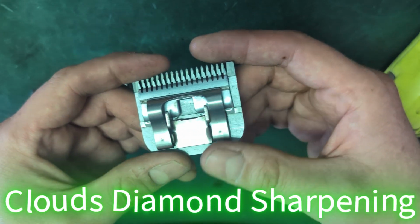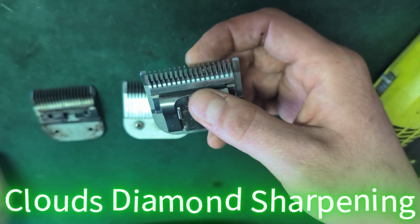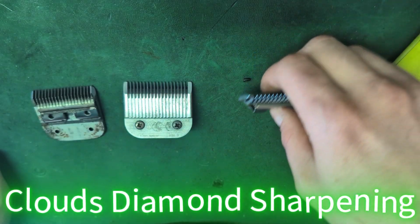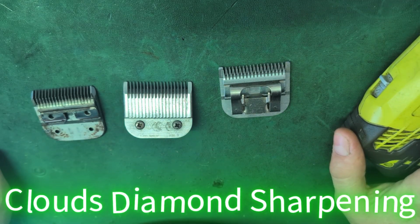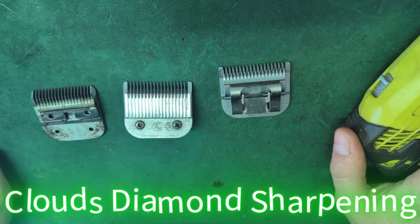If you oil your blade and get it sharpened through us, then your blades will last a lot longer than a new blade, I promise that. And it'll probably be sharper, and sometimes when you buy a new blade, they're not that sharp out of the package. And that's usually because they're sharpened on a flat wheel, or a flatter wheel at least.